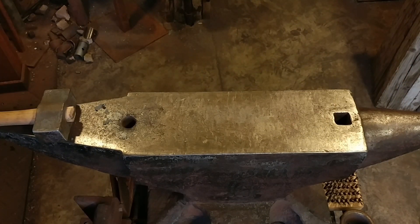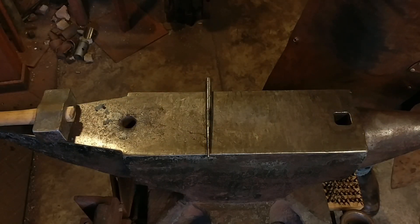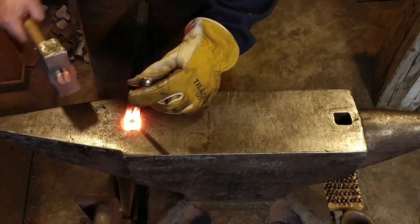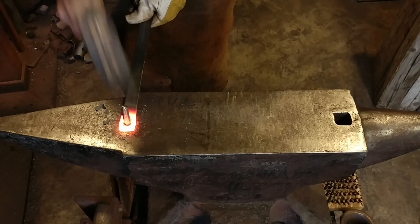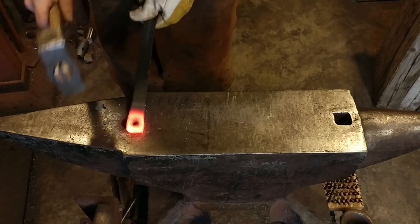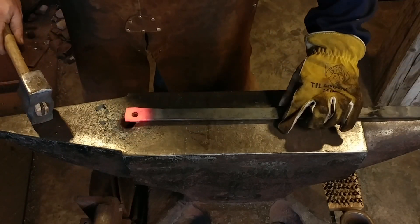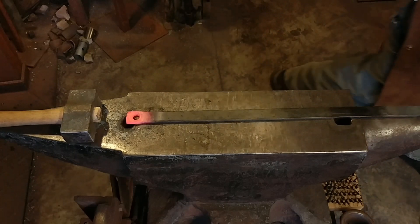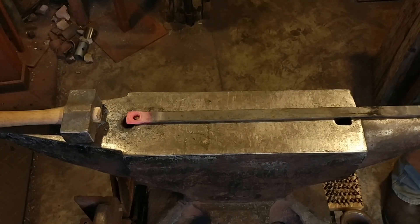The technique is fairly simple — you just want to have nice, even blows. You don't have to rush this. For this video, all I'm doing is heating it with a torch and drifting it out. You take your time with it, keep the metal hot and moving, and just like that you can enlarge a hole. You can see that's quite big now — it went all the way up to half inch, or 12.5mm.